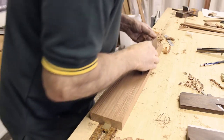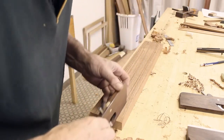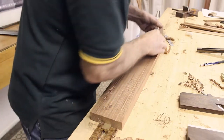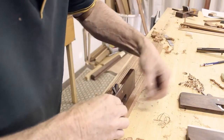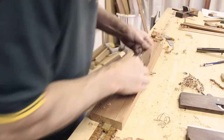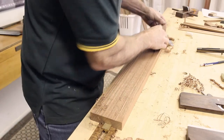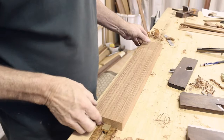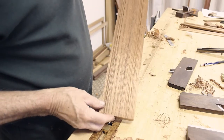Start with your snipe bills. I've got my right-hand snipe bill, just following the profile — don't forget a little bit of wax if it feels like it's bogging down. With that depth of cut, about three passes and I've got enough depth to run my hollow plane. I've got my marking out right because that hollow plane fits in there nicely. Notice you get two shavings, and then when your profile's done you'll get that full-width shaving — that one there indicates to me that the profile's done. It's a nice clean bead.